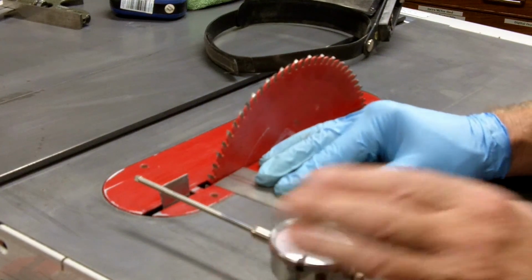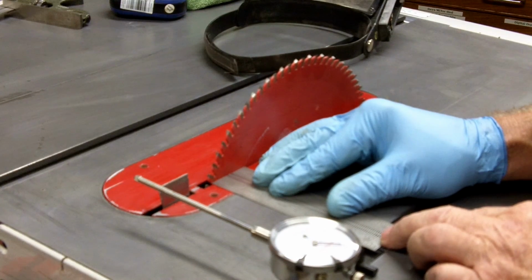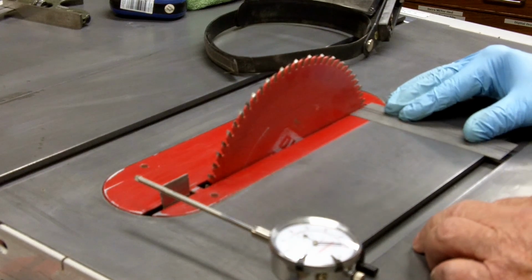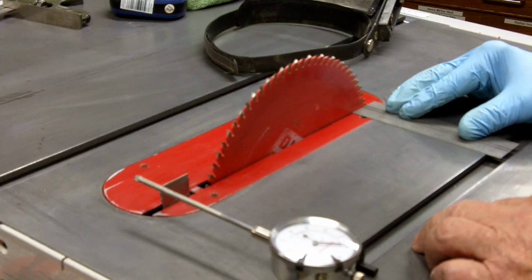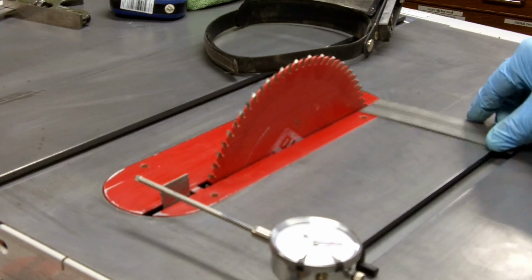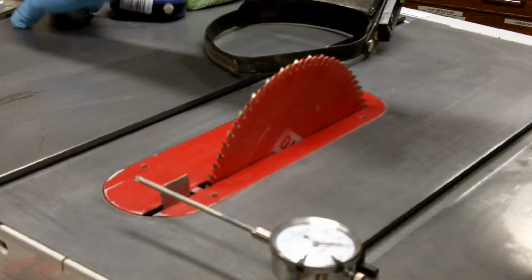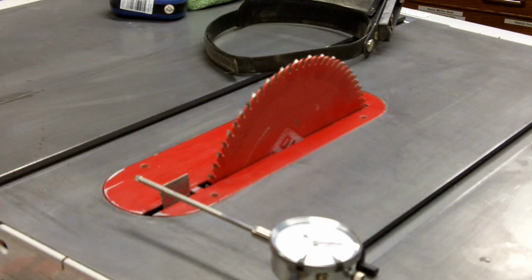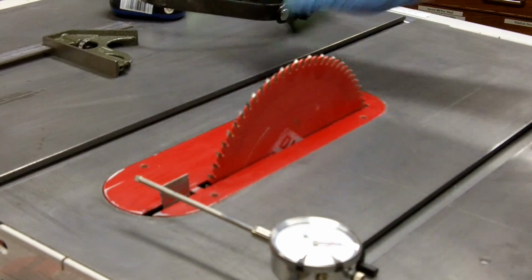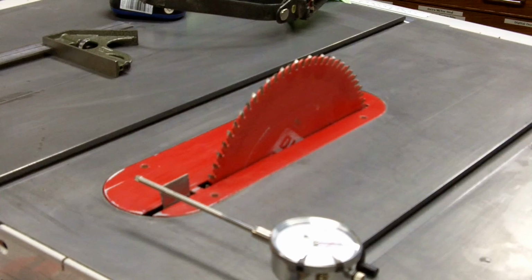So we go up here, we're a 32nd over, we're 17 32nds. Down here it's 5 1/16 even. Now I've got my Mitutoyo. It goes down to 64ths, but even with these, I have trouble getting a 64th right on this line. You know, it's just tough.